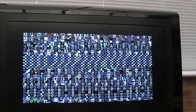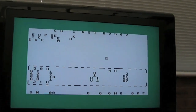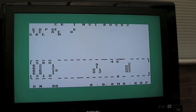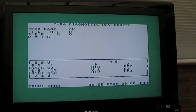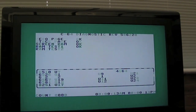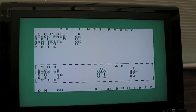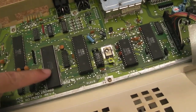You'll see that garbage there when it first comes on, but then it starts to boot the cart. Initially it's almost like it's displaying every other character, but I put that down to the flickering colour issue. I think some characters are showing as the background colour. As it gets through that first test you start to be able to see what's going on: zero page OK, stack page OK, screen RAM OK, RAM test OK, RAM test 2 OK. It's the PLA - bad. I guess that's pointing towards this chip.